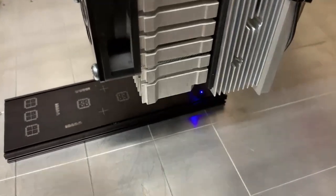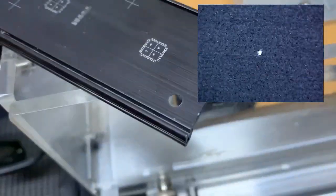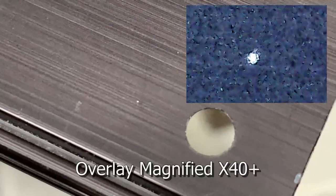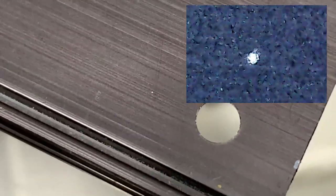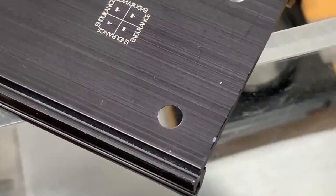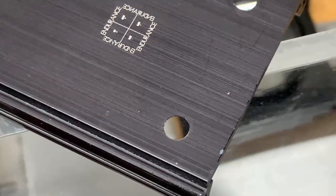I'm going to just flick it to 100% and then off again. I close my eyes and look away to do this because I'm only going to have it on for a second. And I just look — that's the spot. Even without the magnifying glass you can see that's virtually perfectly square, so I know that I'm pretty much on the ball there. That's generally what I do before any engraving — I do that spot test using my scrap piece of anodized aluminium, and when I get it as good as I possibly can that's how I know I'm pretty much focused.